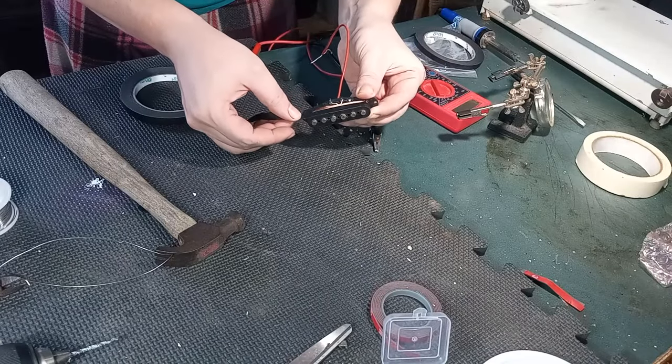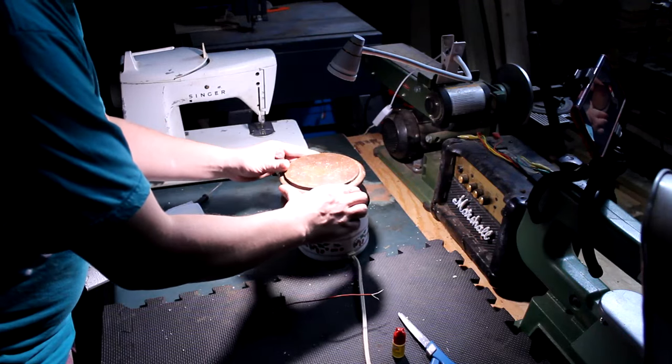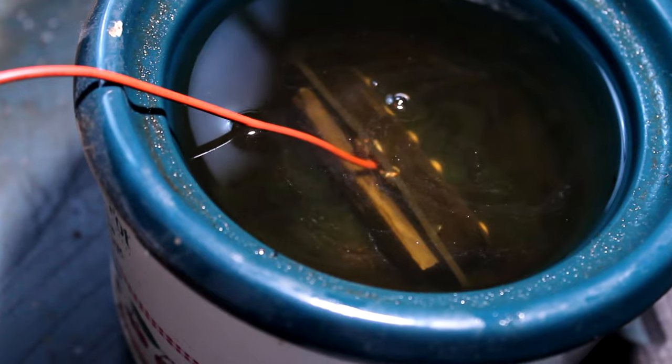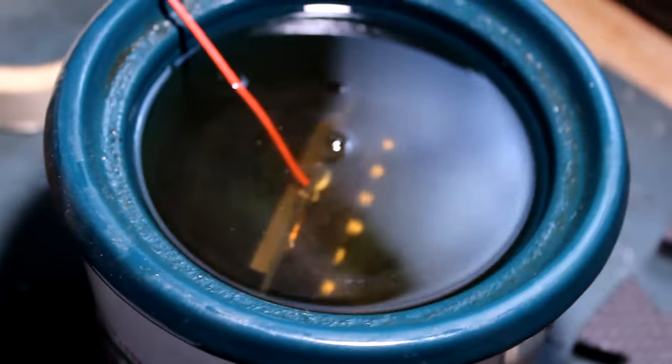I wrapped a coil in some pickup tape, glue a magnet to the back, set it down for a good soak in a liquid wax bath. The purpose of this is to let that wax soak into that coil where all those loose winds are and kind of glue them down when it cools off.